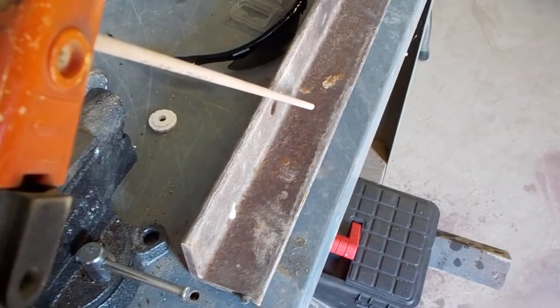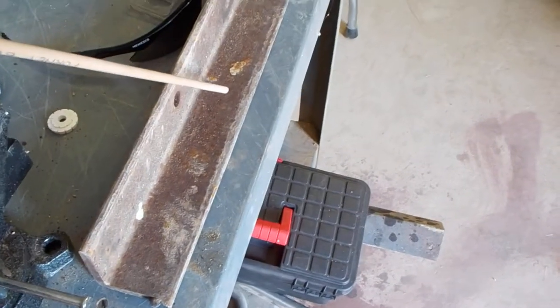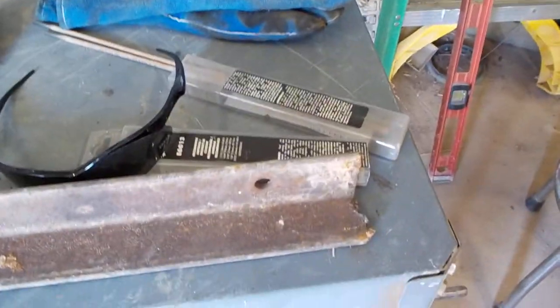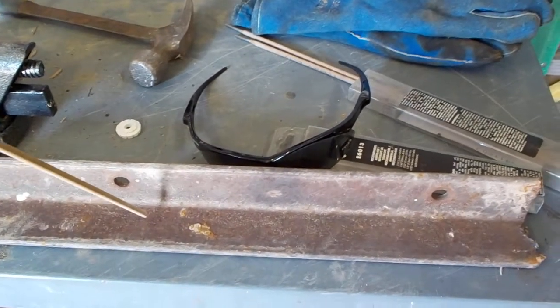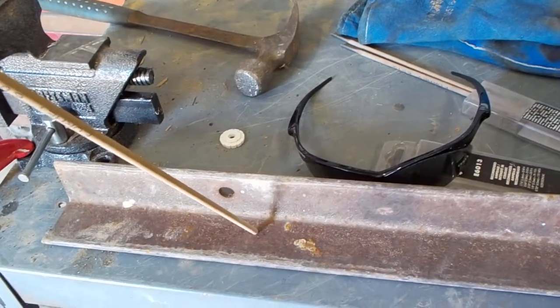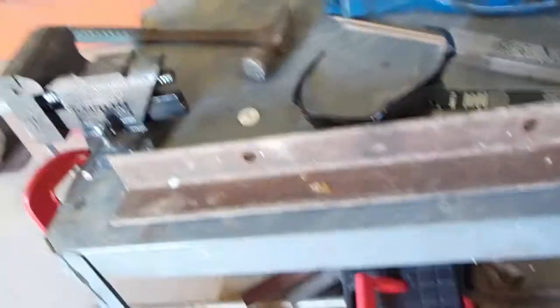You look how far I'm hovering above my metal - not very far. You don't want to go too far or else you won't have an arc anymore. If you go too close, right on the metal, your electrode will get stuck, and you can't get it off until you release it from the electrode holder with this little lever right here. That's the tap method. Another method is striking it like a match - you strike it and then go right back to your metal and do the exact same thing as the tap method. Make sure when you use the match method, you always go right back to where you started moderately - not too fast or else you'll lose your arc. Thanks for viewing, and I hope to go over this welder. Thank you very much, guys - see you all on my channel.